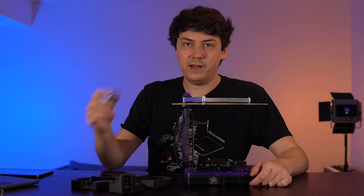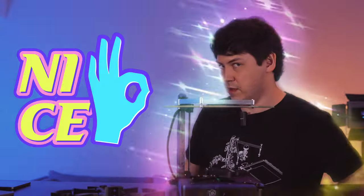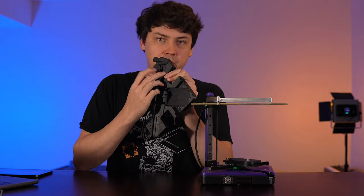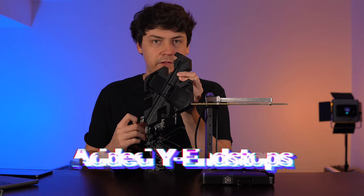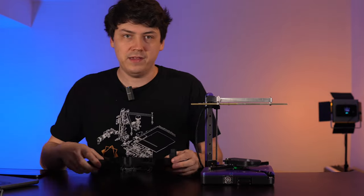Taking a look at the end result — I'm going to call it: the aluminum Z block is cooked. More shavings complete. No compromises made. Another thing is the addition of the Y end stops, which are simply extruded from the main body. Another change is there's no more trimming of the Y axis — the rail just slots right into the cavity, making assembly easy.